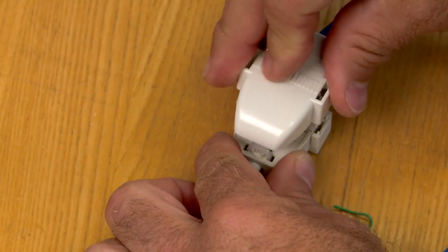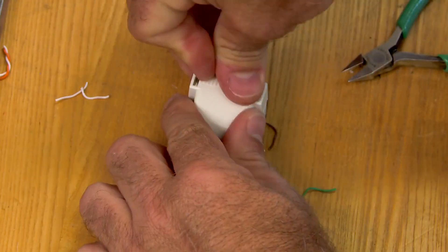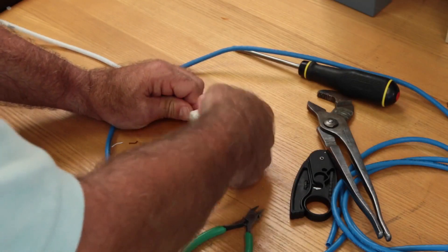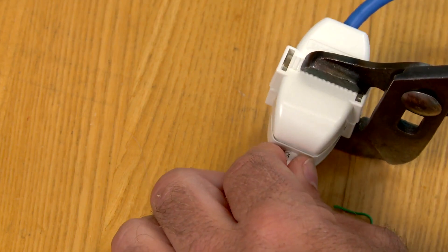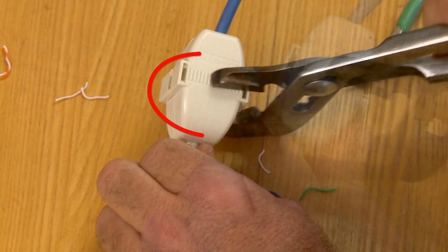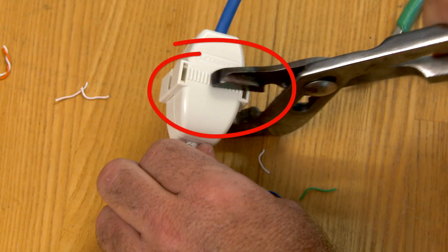Install the cap over the wires, and squeeze it lightly to partially seat the wires. Squeeze the caps to engage retention snaps on both sides of each cap. This may be done by hand, or with tongue and groove pliers. When using pliers, squeeze along the ribbed surface.